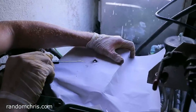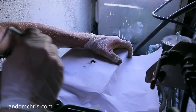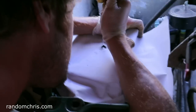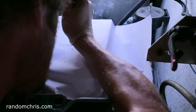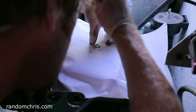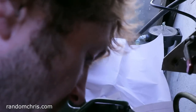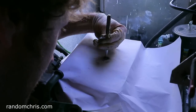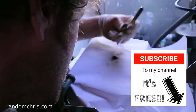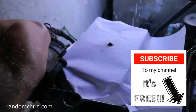The key to drilling a hole in the center of the fastener is to mark it out well from the beginning. I'm going to use an engineer's scribe here and mark out the very center of the fastener. Initially it's just going to be a tiny little scratch, then I'll get a center punch, place it onto my scratch — which I can feel, it's probably only about half a thousandth of an inch deep — and then with the center punch, one tap with a hammer and now you've got a center mark at which to start drilling.